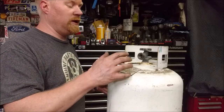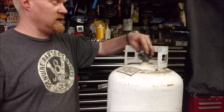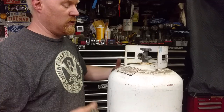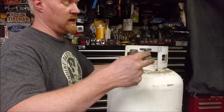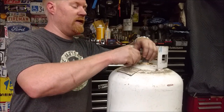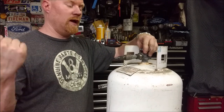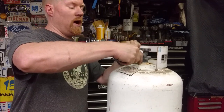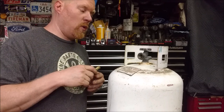Now we need to address evacuating all the propane residue left in the tank. If it's the POL style, you can just open the valve and everything evacuates — 99.9% just evacuates right out, leaving just remnants at zero PSI floating in there. If you have the OPD style, you need to screw in your fitting because it won't open without it; the POL fitting depresses the little plunger and allows it to evacuate. Then just fill it with air, let the air out, fill it with air, let the air out — do that three or four times and the tank is empty.